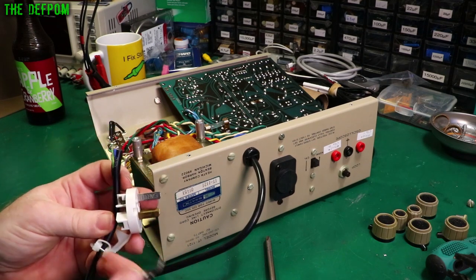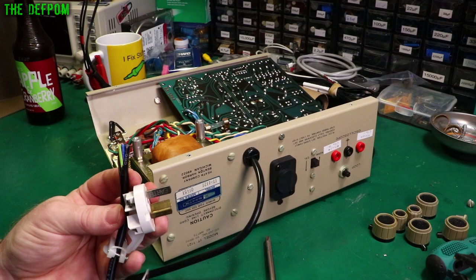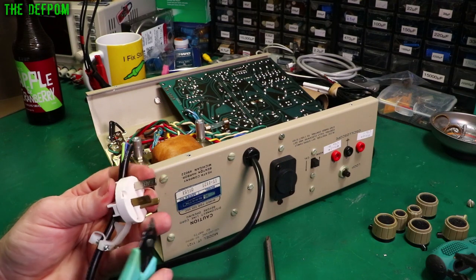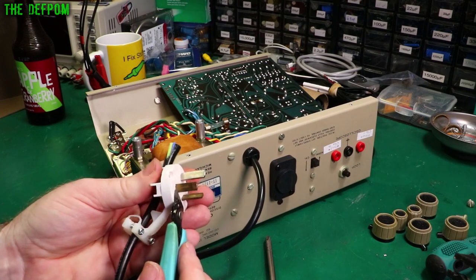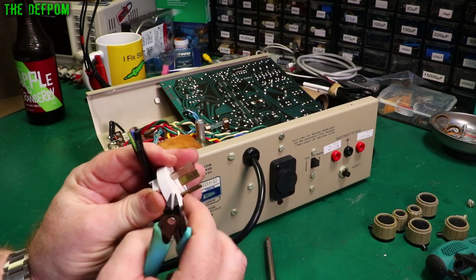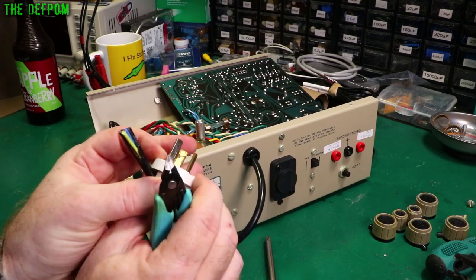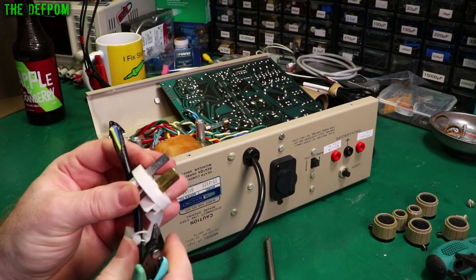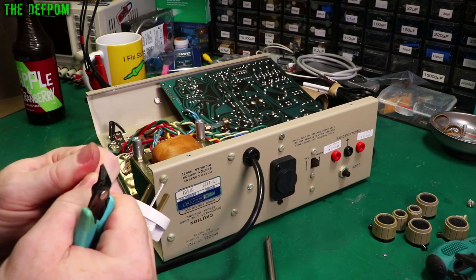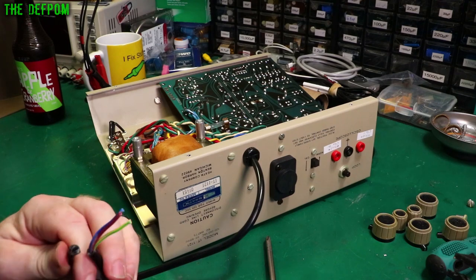Now I'll wire up the plug. I'll just say this — these New Zealand plugs are absolute garbage. The actual New Zealand plug design is rubbish. If you want a decent plug you want a UK plug — they're so robust. The old NZ style has got exposed pins fully exposed all the way down, whereas the newer ones now have a plastic sleeve so you can't touch them. You can actually touch the live pin whilst it's still plugged into mains with this design — I've actually had zaps off these things. It's incredibly dangerous and obviously far more dangerous for children. It amazes me that's the standard plug for this country, and even Australia uses the same plug.